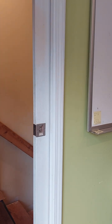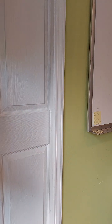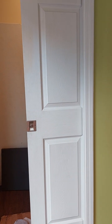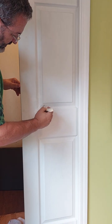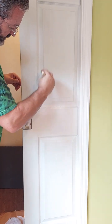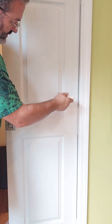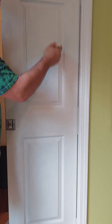The door is going to be exactly the same trick. The door has the trick of having these little recessed panels, so you just want to dab it in the corners and brush it out — again really light, not a lot of paint. Then go with the grain. In the middle, the grain is going to be up and down; on the sides you can see the grain is going this way, so brush accordingly.